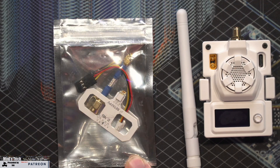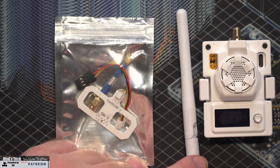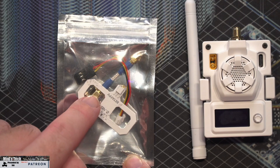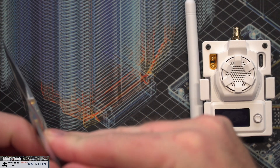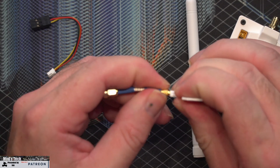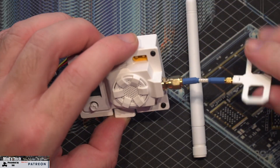For most people you're going to want to use the figure-of-eight antenna compared to the linear — that is the one that's going to give you the best performance overall. It has an MMCX input and they include a little SMA-to-MMCX cable in the packet. To put it together you simply open the packet, take the antenna, push the MMCX in until it clicks, and then screw that onto the SMA port on the module.